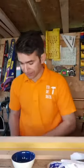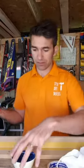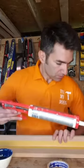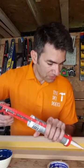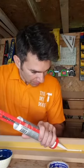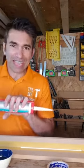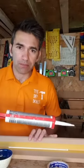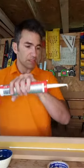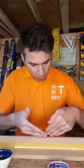Make sure you've got plenty of tissue to hand. Start at one end and squeeze the gun — the idea is a continuous flow along the channel, just like a piping bag. If there's a gap anywhere you can go back to it — it doesn't matter. Once you've run the full length, press the release button at the back to stop the flow. You should now have a bead of silicone along the channel.